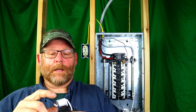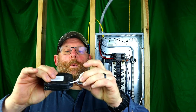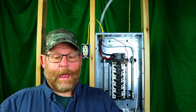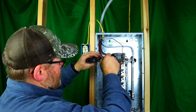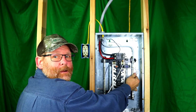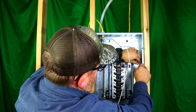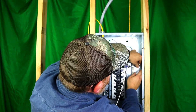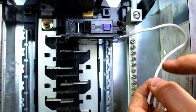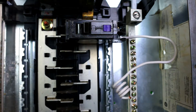Now, what's up with the pigtail? I'm not going to cut this because it will be installed in my home when I redo a couple of bedrooms, but I'll show you what I like to do. I would unroll it — if you have a bunch of breakers in here, you don't want all this pigtail coiled up because that's going to look like a mess. What I would do is form it right here, cut it just so it fits the panel, so all you'd have is this small loop right into the lug.